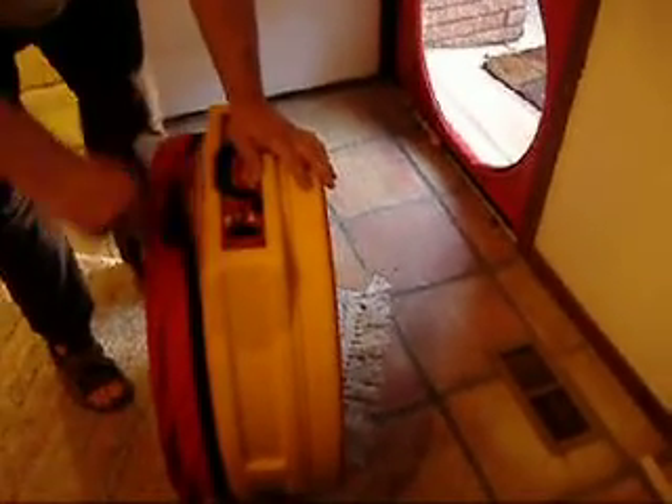That's as far as the door goes. Now we'll start putting in the variable speed fan. This fan contains a sensor inside, which is controlled through the meter. With the meter, you can designate the pressure you want in the house or the speed of the fan.